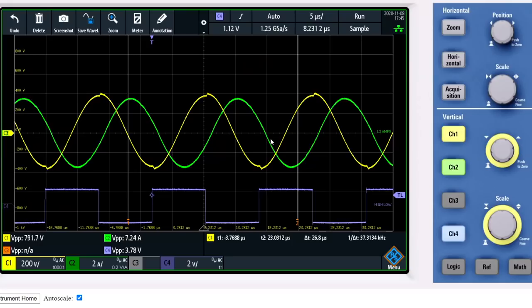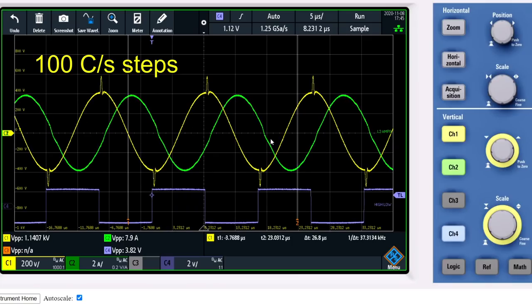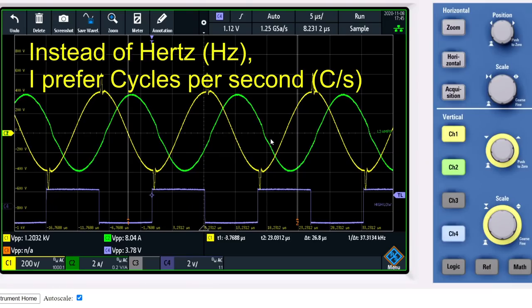If you now tune a bit higher than the resonant frequency of L2, the impulses will appear again on top of the sine wave maximum of the voltage of L2. When tuned correctly, the L2 voltage sine wave grows even more with the added impulse. And I will do that right now. I will tune higher. You can see now the impulses arrive again. At the same time, you can see the voltage sine and the current sine also are amplified, which is pretty odd.